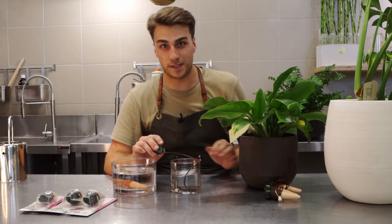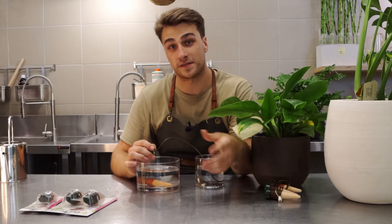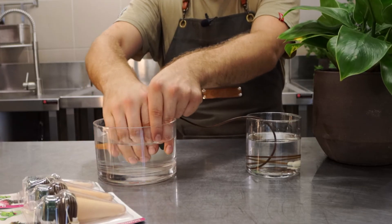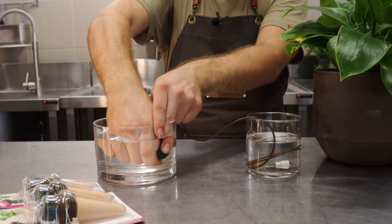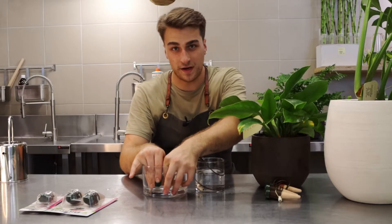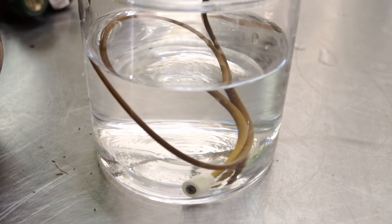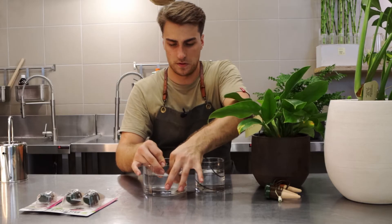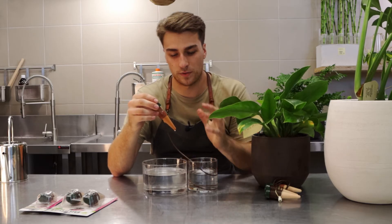Now this is the important part, so pay attention. What we're going to do now is assemble this underwater and make the seal underwater. Assemble them like that and just gently shove it on the top there. What I like to do is do that a couple of times because that forces all the air bubbles out the other side. You can see every time I do it there's some bubbles coming out. It's really good to do that quite a few times just to ensure that we've got all the bubbles out. Once that's assembled, it's very important to keep that other piece of the pipe inside the water just to make sure there's no bubbles.